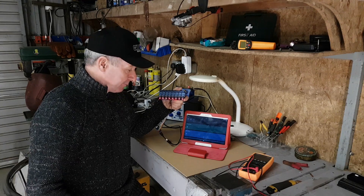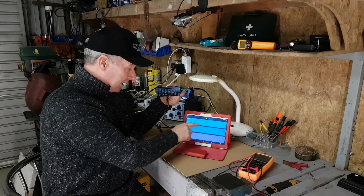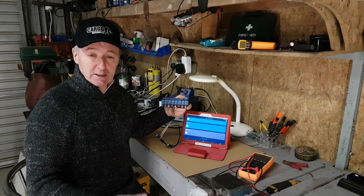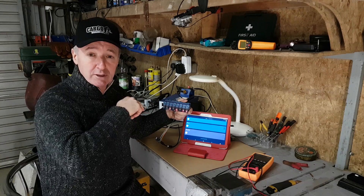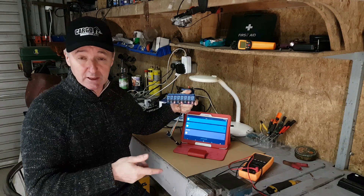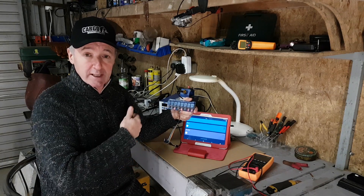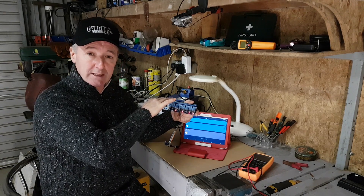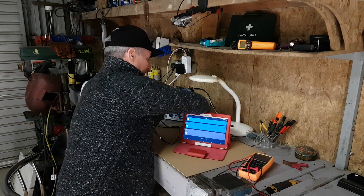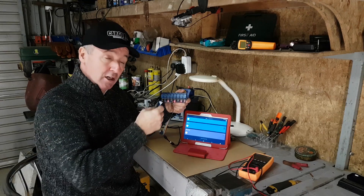Same story — you can hit everything off: Alexa, switch everything off. And that's it. I have different zones — you can break it up different ways. I have one for hot water, one for zone one, which would be like the living room, kitchen, whatever. I can turn on several and they're all powered through thermostats, so when individual rooms get warm enough they'll switch off. Very handy. This whole setup only cost about eight euro — less than ten dollars — and you can control the whole heating system or anything you like. You can put a heap of these together — that's one relay board, but you can have five or ten of these, whatever you want.